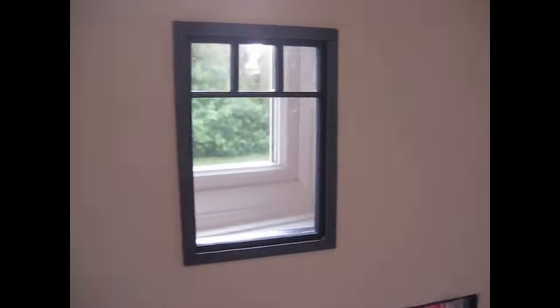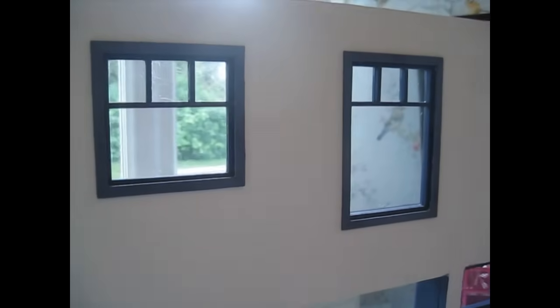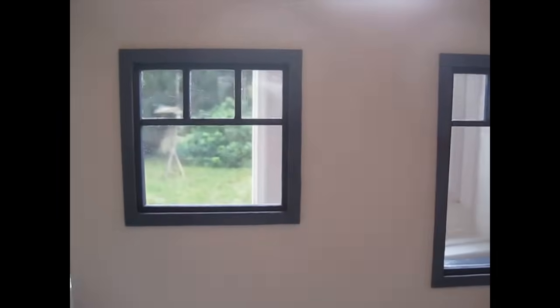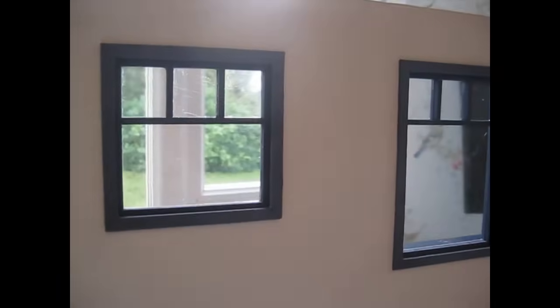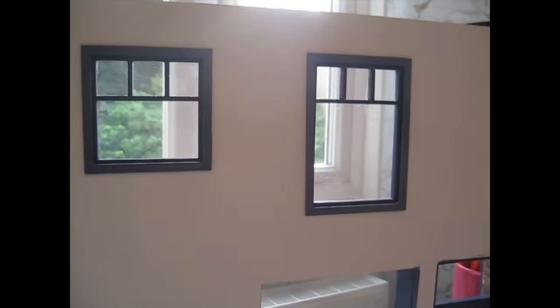But it's quite difficult having the camera on and doing this at the same time, just because I can't get the camera up high enough. So I'll fit them and then show you the results. But I'm basically just working left, top, bottom, right, working quite quickly so the glue's still tacky, and then pushing it all into the frame so that you haven't got too much gap in or anything. I'm really pleased with how that's looking. That's really going to tidy this inside of the door up.